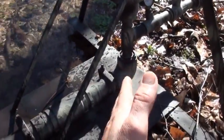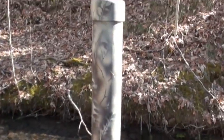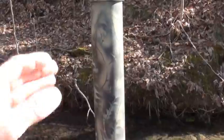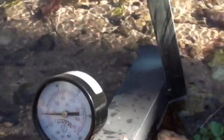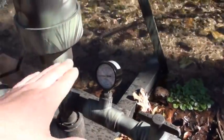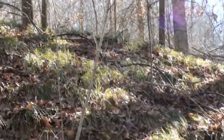That water gets trapped on this side of the pump because it can't escape backwards through this check valve. This cycle repeats 60 times per minute, hammering the water through this check valve 60 times per minute. It builds up pressure. In this side of the pressure tank, there are two bicycle inner tubes at the top of this tank that are inflated. They act as a bladder like on a well tank. The water pressure that keeps getting pushed into the system pushes against the air bladder, and the air bladder in return provides a constant push to get water out the discharge — normally at about 20 PSI — pushing out this discharge pipe and then going up the hill, 40 feet.